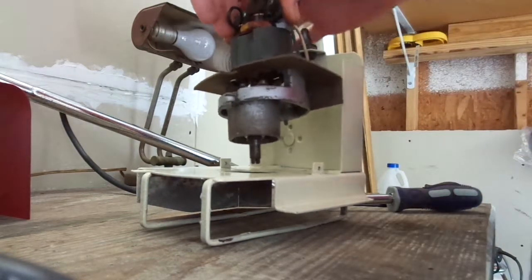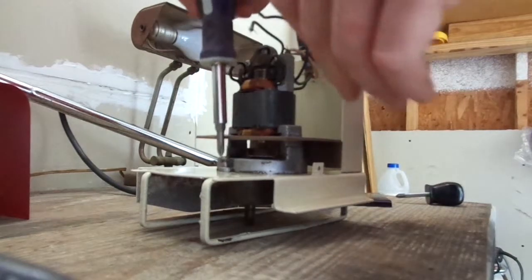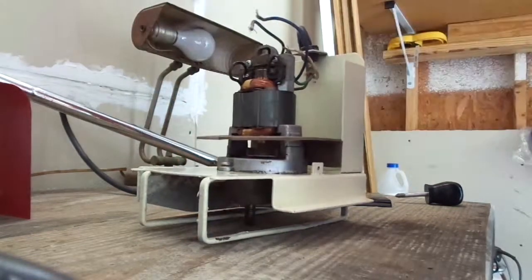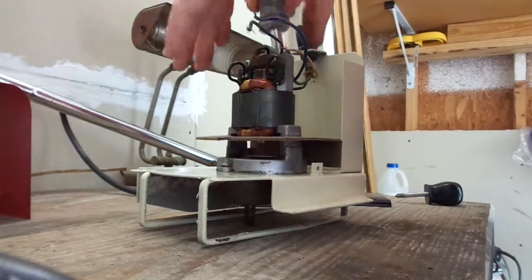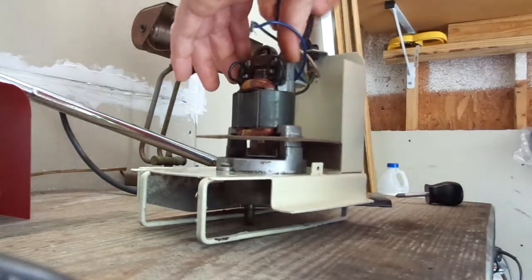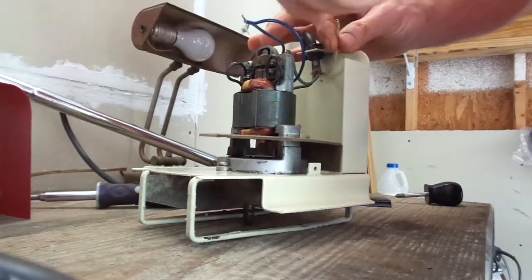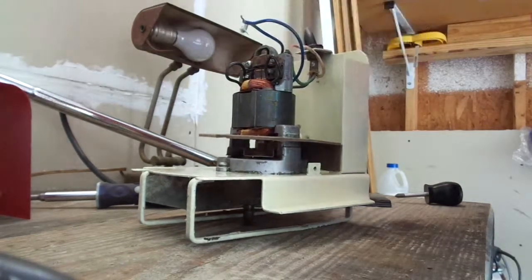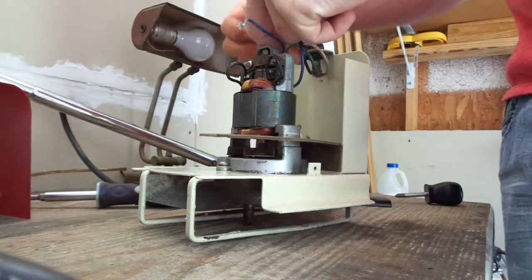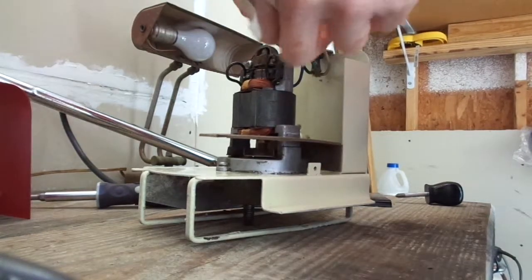Okay. That's tight. Now then, that down in. And tighten up the mounting screws. Yeah, so basically just this piece is on backwards. There we go. Alright, now then, to install the wires. Good thing I kept track. So the clean blue wire went to the black. And held together with wire nuts. I don't normally use wire nuts, but that's how this one was assembled and it worked.